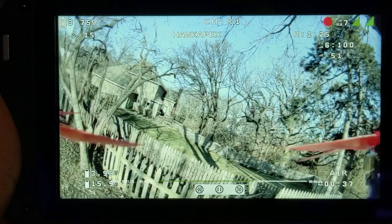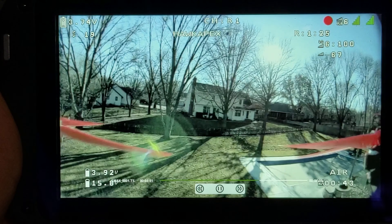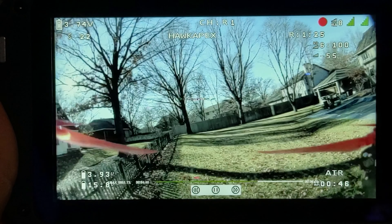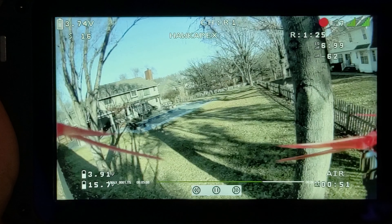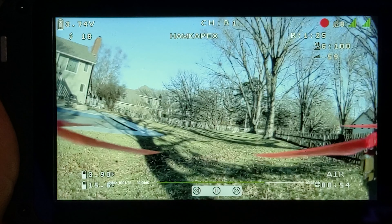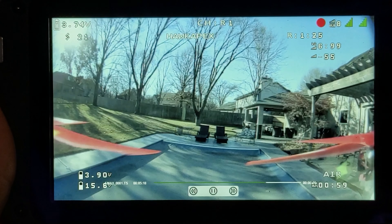There should be a number of videos out on these goggles, so do your research regarding reception and take note of different environments. Reception is a variable in this hobby — if you're close to a cell tower, police radio towers, or any RF source including your home WiFi, it can be problematic for FPV reception. One thing I do to avoid traditional WiFi interference is fly race band eight, which is a frequency above the WiFi frequency and can really help with video reception, especially for analog.